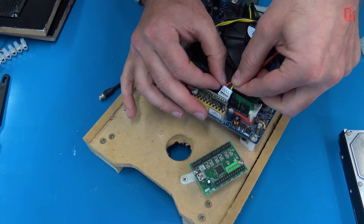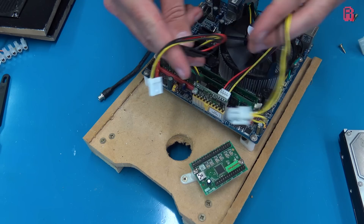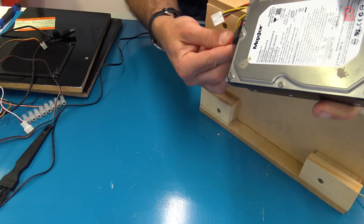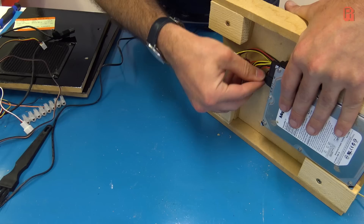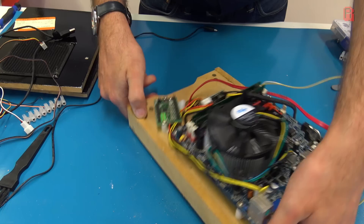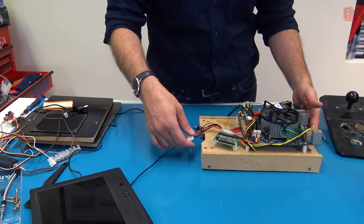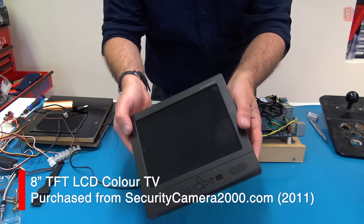So let's plug it all in, cross our fingers and hope it all works, because anyone who's configured an arcade knows how many hours goes into tweaking one — or at least that was the case back then. I know things are quicker these days with RetroPie. An SSD drive would be the first thing to change here if not replacing it all for a Raspberry Pi — and you'd be right on the SSD — but performance-wise this is actually quite a bit faster than a Pi. The emulators are well optimised for the CPU, and it has a trick up its sleeve: the system board has a built-in GeForce GPU, so some more complex 3D emulators can get a good frame rate. To test it we'll need a monitor — this is an 8 inch TFT with composite and VGA input, and a built-in aerial for terrestrial TV channels.